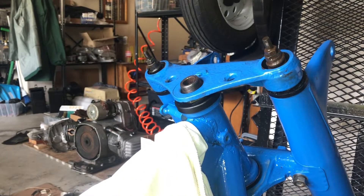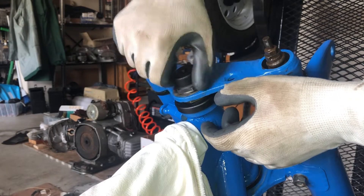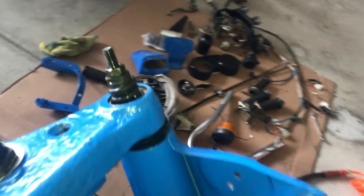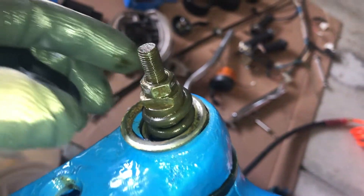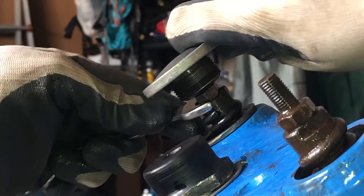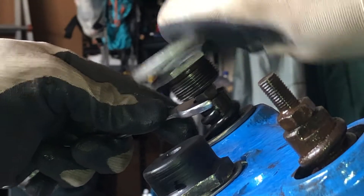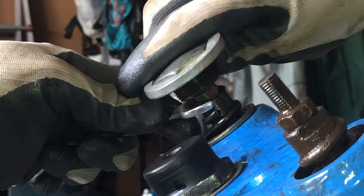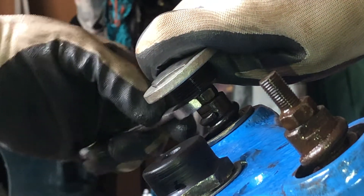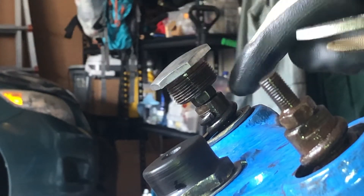Now there is the cross piece, lock washer, and another nut. There should be a small gap between that nut and the spring assembly. Once we screw in the big tightening nut, we still need to make sure that the gap is preserved — it's pretty hard to do and takes some time. Now the gap is too big, we have to redo it and make it smaller. Alright, now it's good.